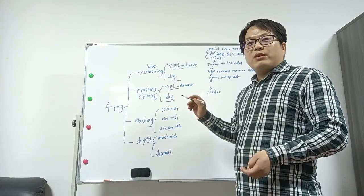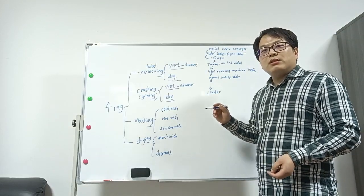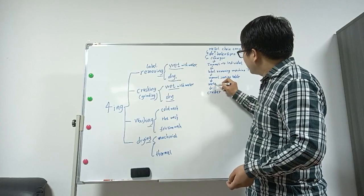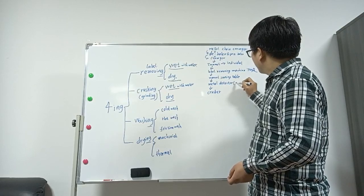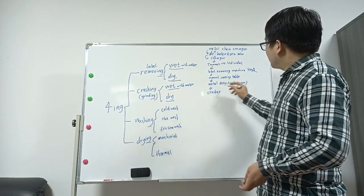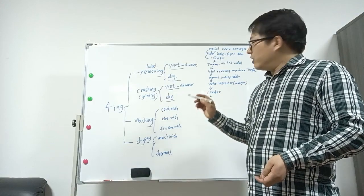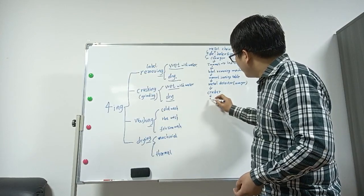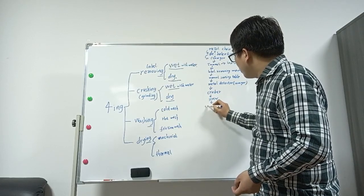As some metal is very dangerous for the crusher, for the blade and the shaft. So before the crusher, we need the metal detector. Then through the conveyor to the crusher. After the crusher, we can get the small flakes. Small flakes need to go to the wash. Of course, to the cold wash, we need the screw loader to connect to the cold wash first.